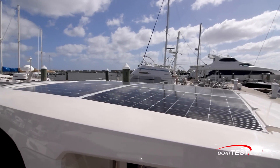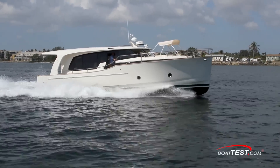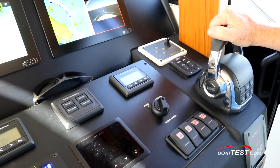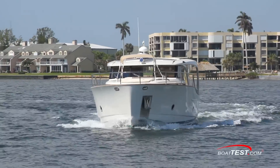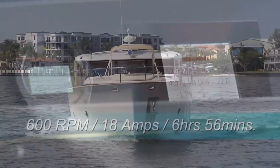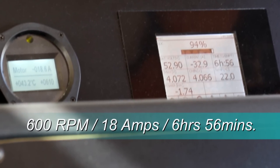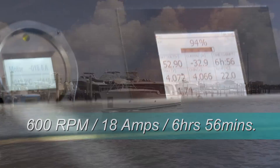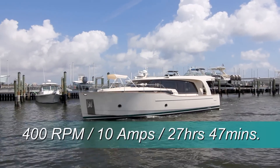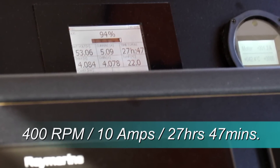Sit at the dock under the solar panels or start the diesels and the batteries recharge, and you have more cruise time. We don't go by RPMs — we go by amps being drawn. If you adjust the throttle to keep the draw just under 50 amps, you'll pretty much be at your best cruise between power going in and power going out. At 600 RPM, we drew 18 amps and the endurance shot up to 6 hours and 56 minutes. While cruising through the marina, we backed off to 400 RPM and drew only 10 amps — endurance went up to over 20 hours, still with all the lights burning and air conditioner running.